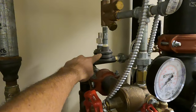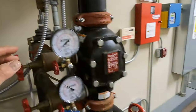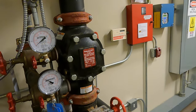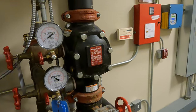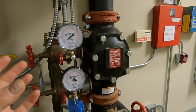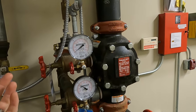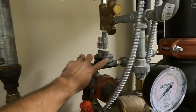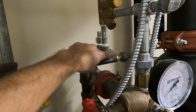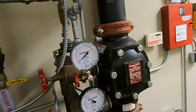Here's your actuator that's making this all low pressure. A lot of dry valves are differential dry valves — typically a six-to-one differential. This one is not. It's a mechanical dry valve. Once the air pressure comes off this actuator, that's going to allow the valve to mechanically open.